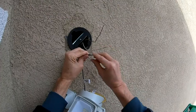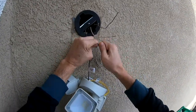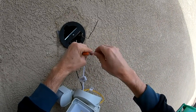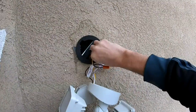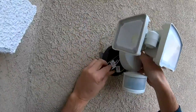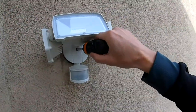Wiring this up, doing the black wire first — though it really doesn't matter the order. I'll do the white next. This is always a little hard because you have to make sure the light doesn't fall while you're wiring. Remember, twist everything clockwise when tightening, including the wire caps, as tight as you can by hand. It's good to have a second person hold the light while you're wiring. Everything is wired up and I'll carefully put the wires back in the box, making sure the connections are still good and no wires are touching each other. Put the light on the center screw, grab the bolt, make sure it's straight, and tighten things up.